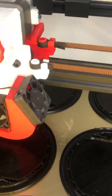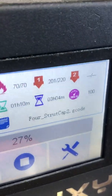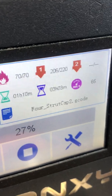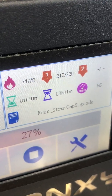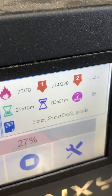You can see it there, it's stopped now. Let's watch the extruder temperature — already you see it going up. So what this proves is that the part cooling fan is very effective; it's actually too effective. But it also shows the value of insulating the hotend. The heat block should probably have insulation on it.